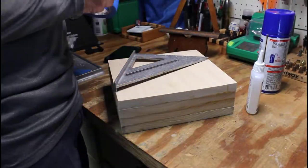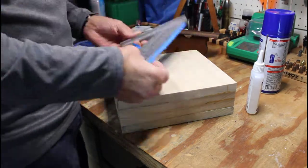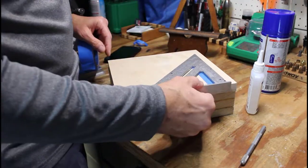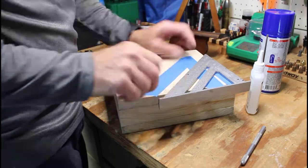As you can see, after using the sandpaper technique, the wood managed to move, causing the entire piece to be out of square. So I'm taking a framing square, gluing it to the surface, creating an artificial edge so I can take it to the table saw and square this piece up.